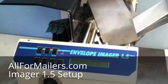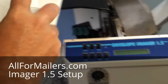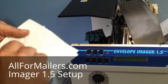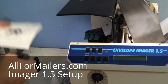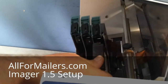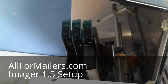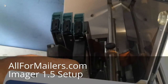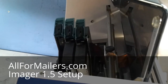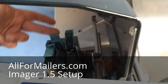At this point we can go ahead and get our ink cartridges ready. You want to have a paper towel, dampen it, grab your cartridges, and just kind of twist and push back — make sure they're clean. The clip goes up when you put these in. Put them in on an angle so that they go down in there, but don't push them all the way over, just leave them hanging off like that, and you want the clip to pull them in.